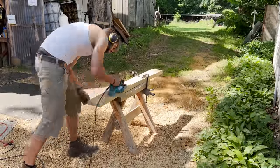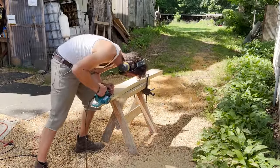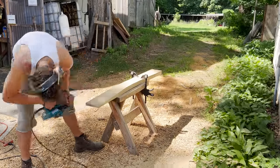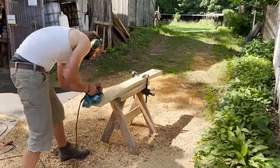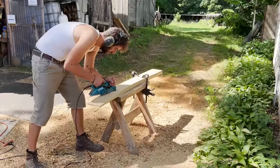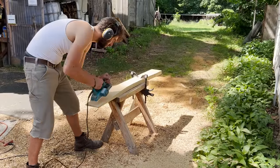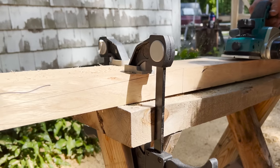And Sam took a different approach to cutting out his scarves. Instead of making kerf cuts and using the adz as KP did, he just went for it with the power planer and judged based on the pencil markings. If you remember from his introduction last week, his boat shop experience is mostly with large work boats like the AJ Meerwald, where the power planer is extremely common for all sorts of jobs. So this was a natural and comfortable method for him.